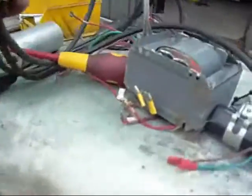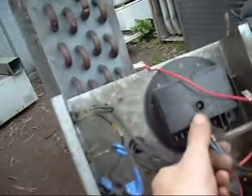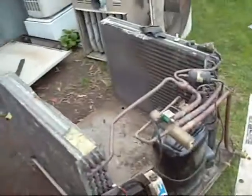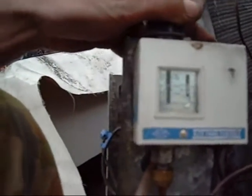The only thing that is missing is the control transformer — the old one burnt out obviously, and the other one is up here. That's a step-down from 415 to 240 volts, not 24. The 24-volt control comes from in there — that's the 24-volt control transformer. This thing here is also your high-side pressure control — it's got cut-in and cut-out based on pressure difference. It just regulates the high pressure discharge pressures and shuts it down if it gets too high.